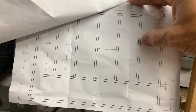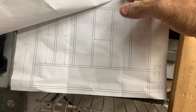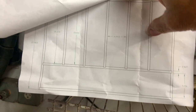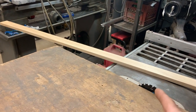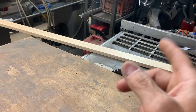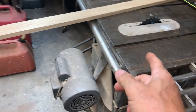I'm going to make these perimeter pieces out of some half-inch plywood I have in the house — not my first choice, but it's an economic decision and I have enough of it. I don't want to see the end grain on all these pieces, so I'm going to glue a cap on the top edge of each piece using some solid pine. That should be enough to do the whole thing, or at least half of it. Let me get my old sled here and set up to do the rip cut.